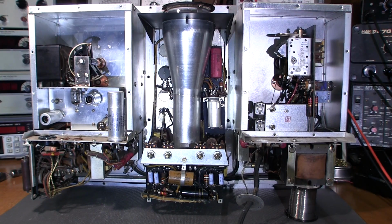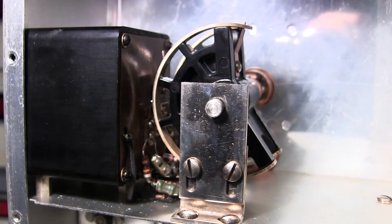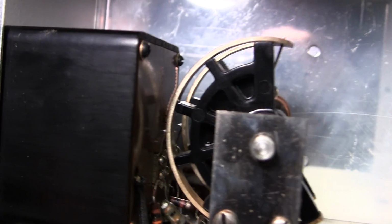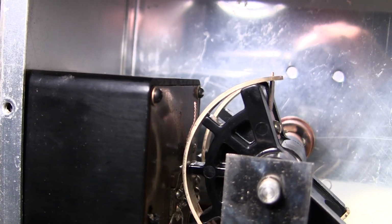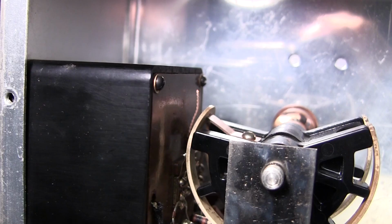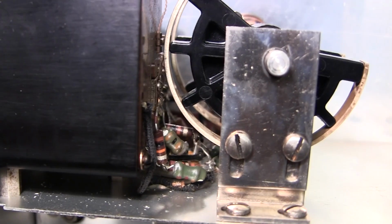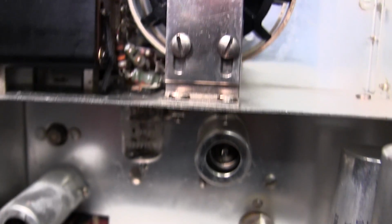these boxes. All right, here's a close-up of that variable inductor inside this FM signal generator. You can see the little fingers there that rub that inductor. And if I can move this, you can see how that inductor moves around. So it'd be going up in frequency right now, and this would be going down in frequency. You can see the short components down there on the bottom side of the box. Again, lead inductance is a big issue.